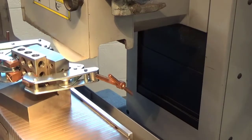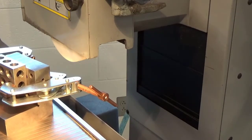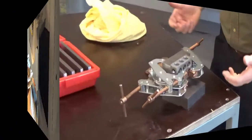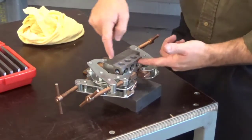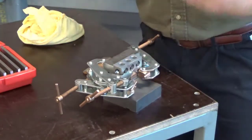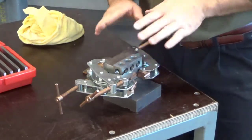I'm going to take this part off, winding my Y forward so the clamp doesn't interfere with the wheel. I'm going to stone all the faces while still here in the grinding room to prevent grinding grit from getting in the inspection lab. Then I'm going to flip these clamps around so I can grind this face. The idea is to keep at least two clamps clamped on this at all times.